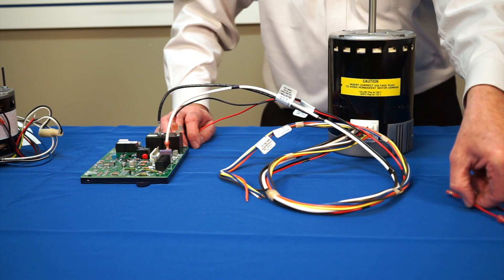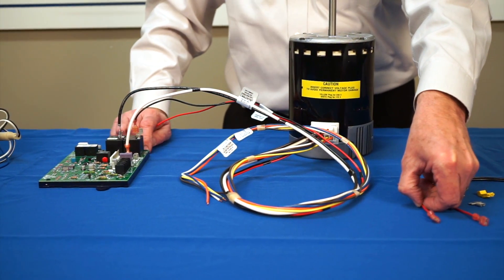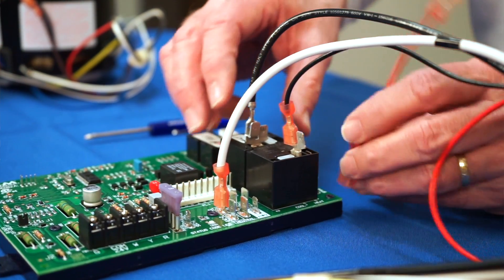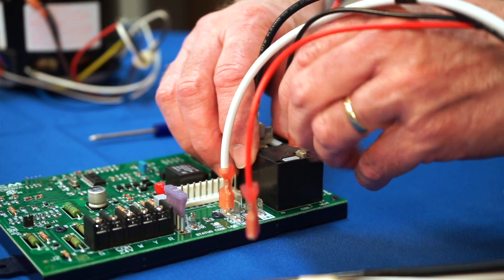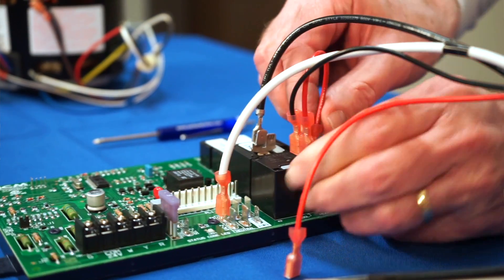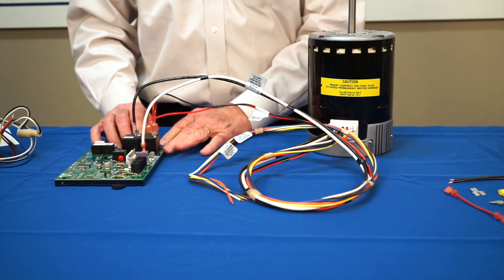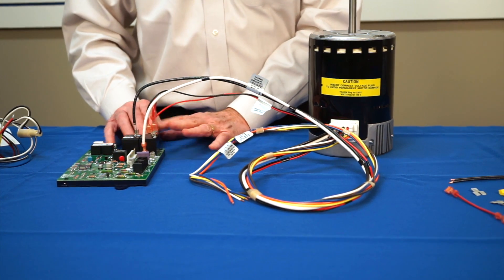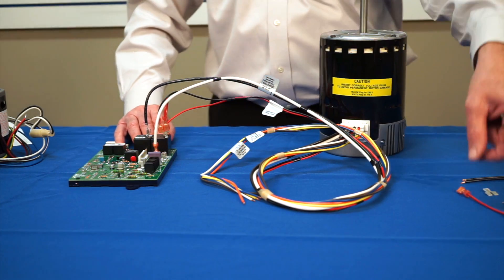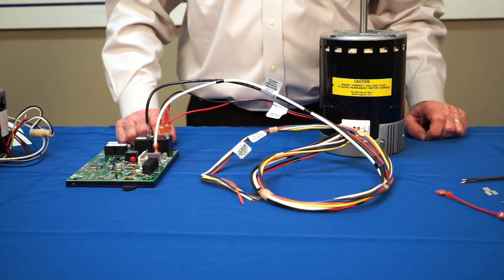The EC-MAX also has jumpers that can be used to continue my circuit on the high voltage. I take one of the red jumpers and attach it to cool, and jumper that to heat on my board. This particular board does not have a constant fan feature on it. If there were a constant fan, I would use my second jumper from heat to provide high voltage to my continuous fan.